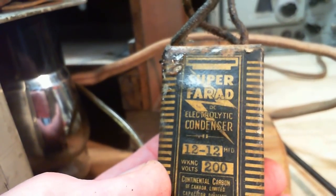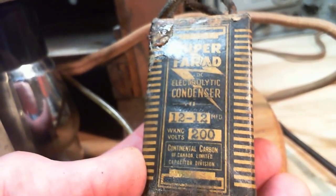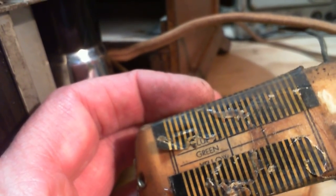Friction tape has turned out to be a really excellent tape to use in these things — what we call friction tape today. Because this stuff just goes solid and stays put. When you use the modern kind of electrical tape, this stuff just is gooey and runny and a horrible mess after so many years. I'm going to go in and cut that wire and leave the splice in there. This means this guy should just pull out now. Looks like some kind of octopus lead in there.